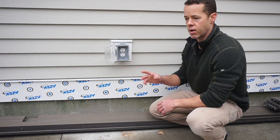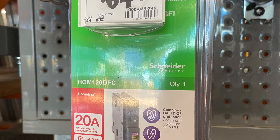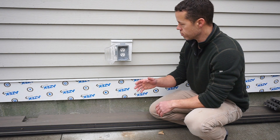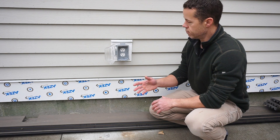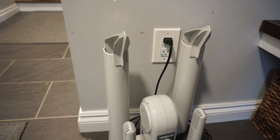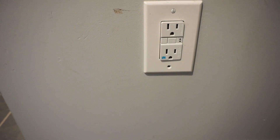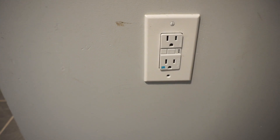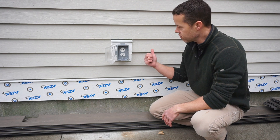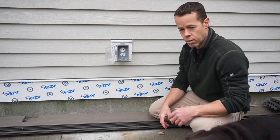There are a few different ways to do that. The first way is to have a GFI circuit breaker wherever your circuit panel is — if your circuit breaker is a GFI circuit breaker, it protects everything on that circuit. Those are expensive, so that's why I didn't do that. The way I protected this one is the first outlet in the mudroom is a GFI outlet, so everything downstream from that outlet will be GFI protected. Instead of having a GFI here exposed to the weather, bugs, and cobwebs, I just chose to have the expensive outlet inside and use a cheaper outlet outside. If something does happen to it, I can replace it — it's just a couple bucks, no big deal.